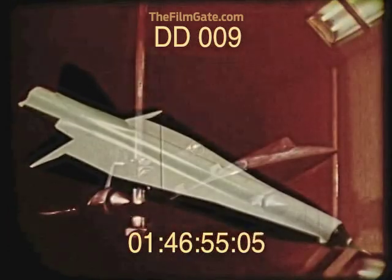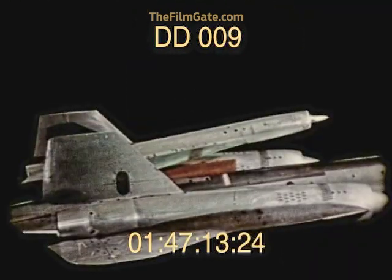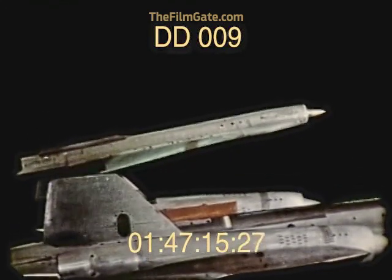These are 1/12 scale models of the drone and the launch vehicles in the subsonic wind tunnel. Here, aerodynamic characteristics of separation were tested by using two separate model mountings, each fully equipped with instrumentation. With this new wind tunnel technique, forces, moments, and pressures were measured on both vehicles simultaneously during the simulated mission and launch.